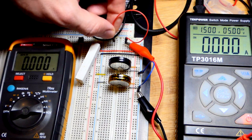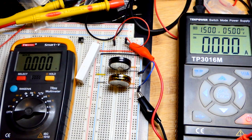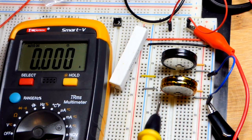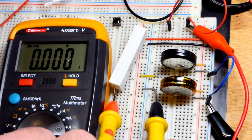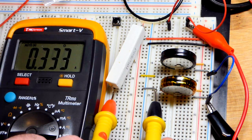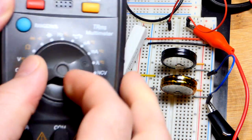First we have to unplug the power supply. The current feeding in dropped to zero — the power supply is completely disconnected. Whatever current we get will be due to the capacitors and the resistor. We expect 1 amp, but let's watch what we actually get. You can see it was closer to 0.5 amps. And as the voltage of the supercapacitors goes down, the amount of current goes down as well — it's still going through the resistor.